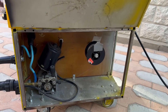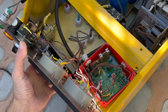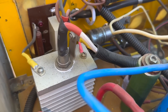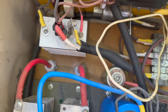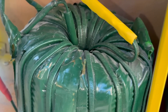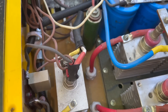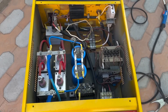There is a door on the side for quick access to the reel and for reconnection or polarity change. The device is powered from a single-phase 220 volt supply, which is supplied to the power regulator through a circuit breaker. It's a phase-pulse power regulator made on an old 40-amp triac which stands on a huge radiator and doesn't heat up at all. There is a primary dimmer and it works perfectly. It is important to know that the power transformer is disconnected from mains during idle time and is only activated during welding — this saves electricity and the transformer will not waste heat. That is, our triac is both a regulator and a contactor. There are no mechanical contactors, no starters — everything is solid state, durable and reliable.